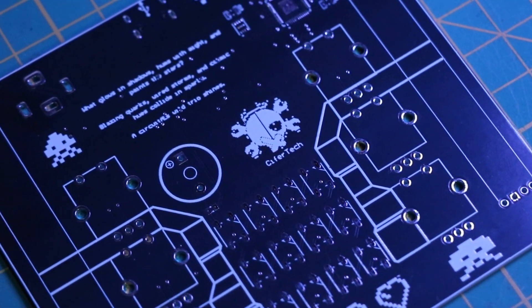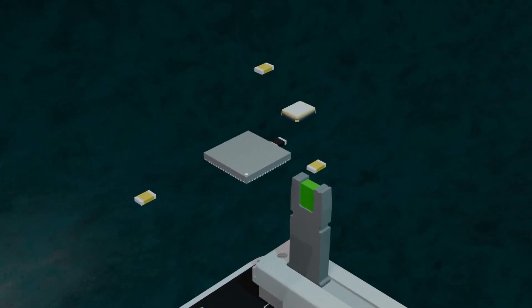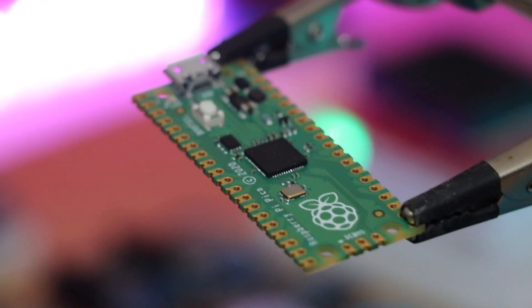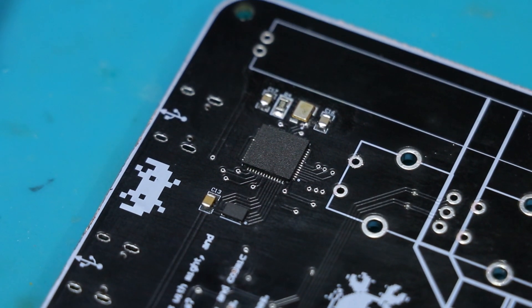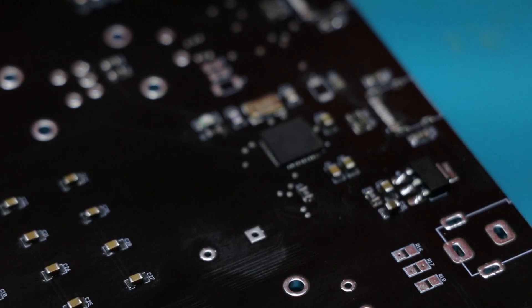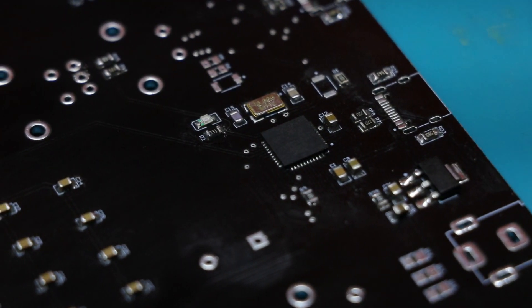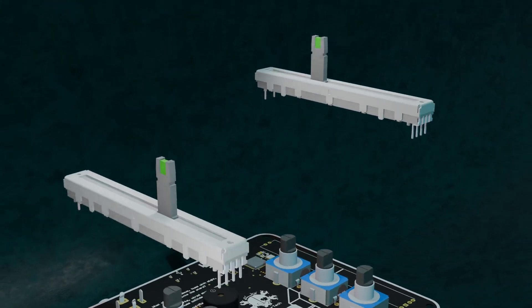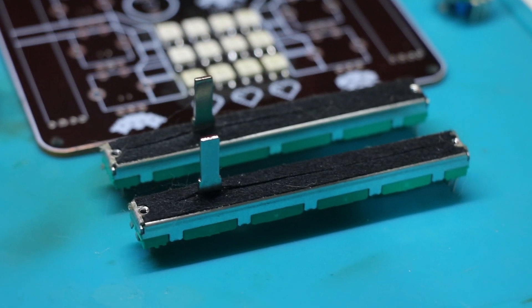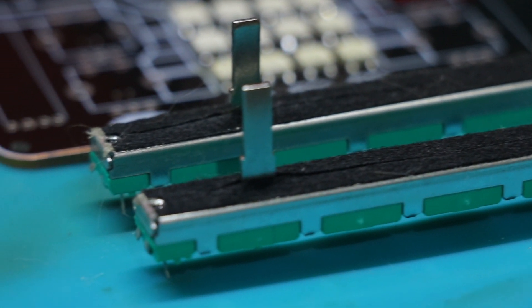For this project, I designed a PCB with the following components. The RP2040 microcontroller handles the logic, reading input from the potentiometers and rotary encoders, and communicates with the ATmega32U4. The ATmega32U4 manages the TV-out for video output to display the visuals on the TV. Two potentiometer sliders control the movement, like up and down or zoom in and zoom out, via analog inputs on the RP2040.